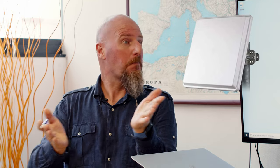You mean like a directional one — the panel antenna for the CPE, for example. The standard square, 30 centimeters wide, usually has a gain of 20–23 dB, and the aperture — vertical and horizontal — is 10 degrees. It was perfect for my idea.